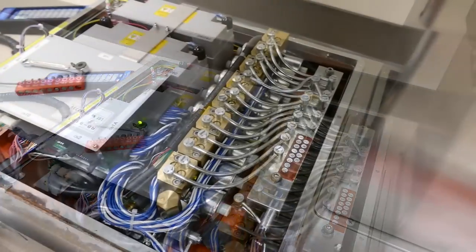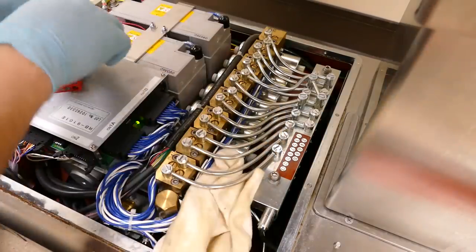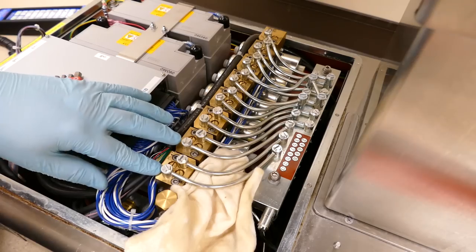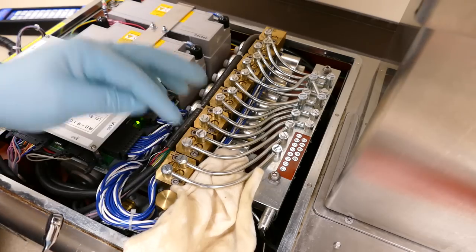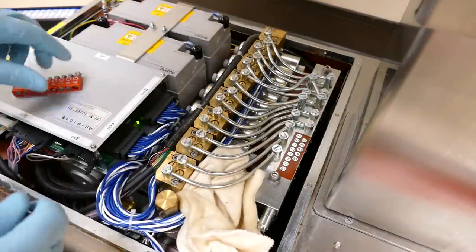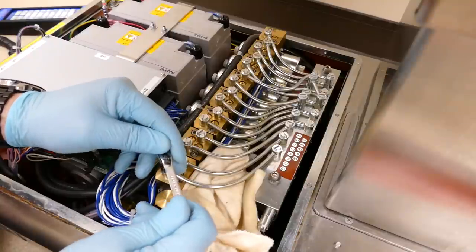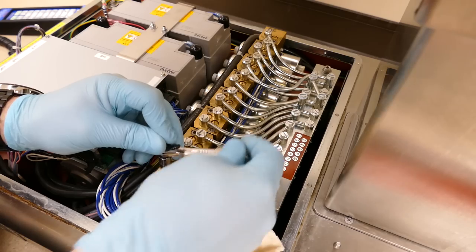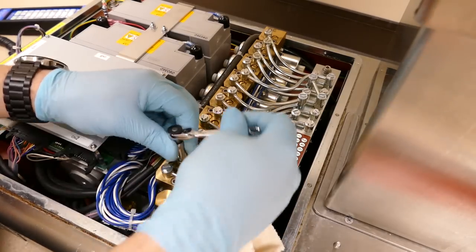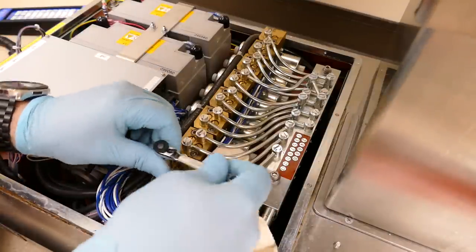The hydraulic assembly in question is this first one. I'm going to shove a rag right up and under here as tight as I can, right next to the block, because as I crack these open there are going to be tiny little o-rings that will shoot out because of the pressure. We need to collect as much hydraulic oil as possible so we don't get it around the solenoids and down in the basin. First socket I'm going to use is an eight millimeter — I'll pop it over these caps and loosen them up. You can see the hydraulic oil shooting out, and the o-ring is kicking out due to the pressure built up in the hydraulic system.